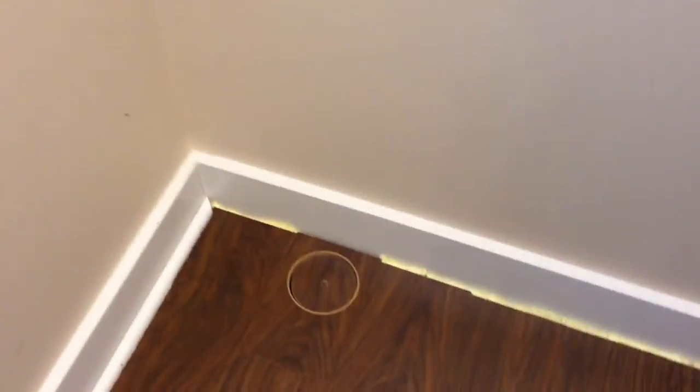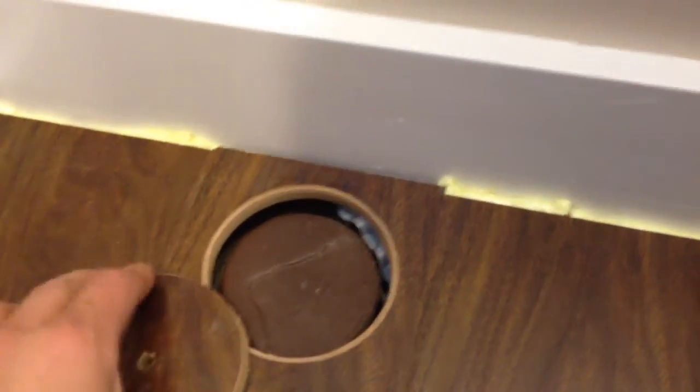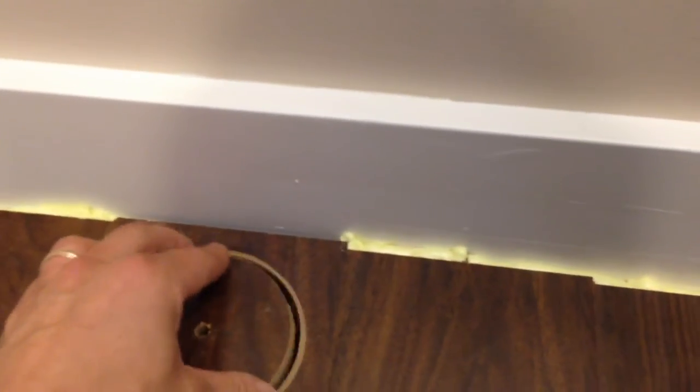So what I did was fill the foam here on the edges, since the flooring has to be around 3/8 of an inch away from the wall when you install it on all sides. That leaves room for you to put a straw from the tube of foam, and you just fill underneath the subflooring, and it comes up, so it seals the subflooring.